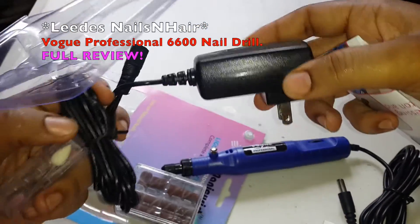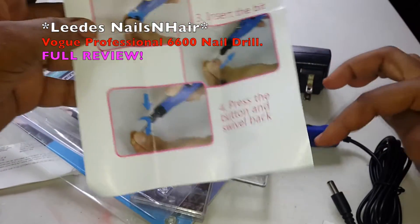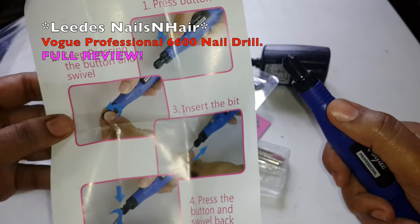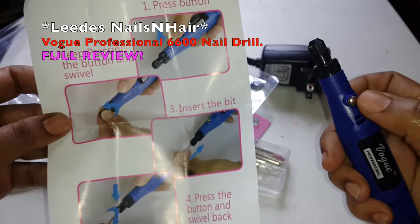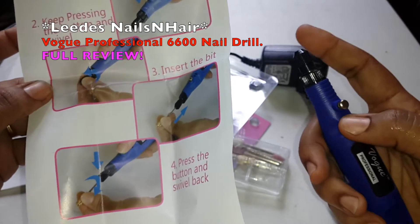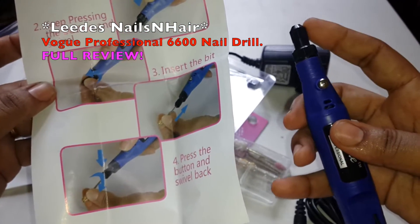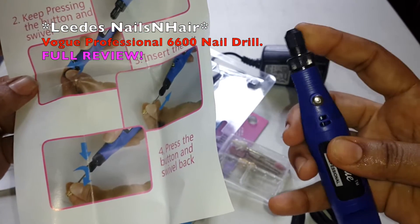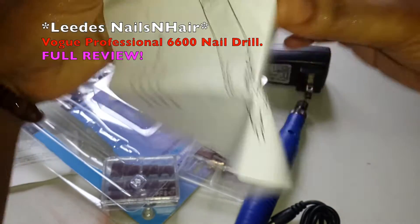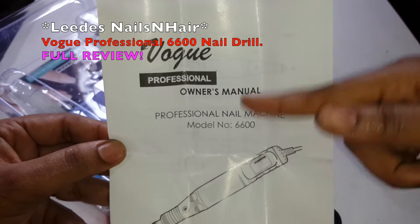And the adapter to plug into the drill. This is a paper telling you how to assemble the bits into the drill. Number one, you press the button — which is this silver button here. Number two, while holding the silver button, as the diagram shows, you swivel this, insert the bit into the hole at the top of the drill, push the drill bit down until it can't go anymore, swivel it back until it locks, and remove your finger off the button.